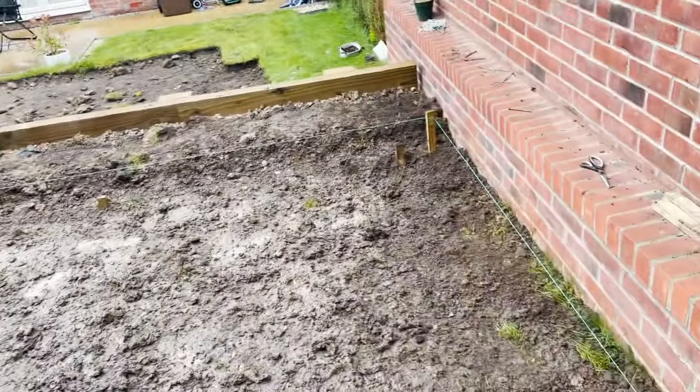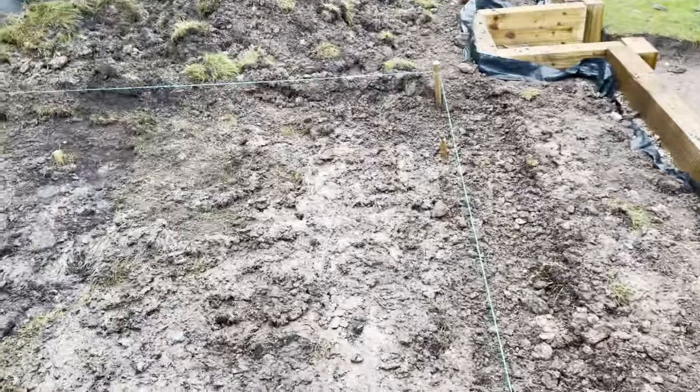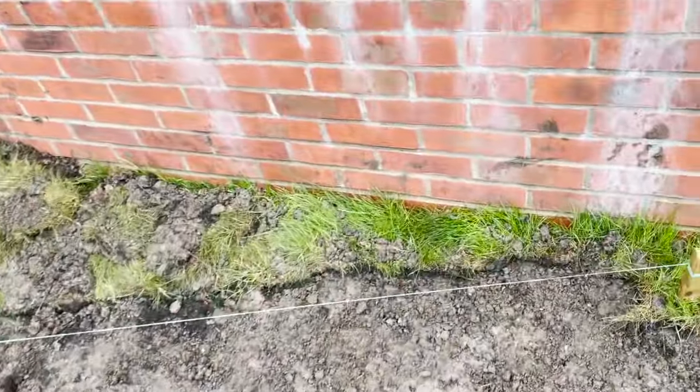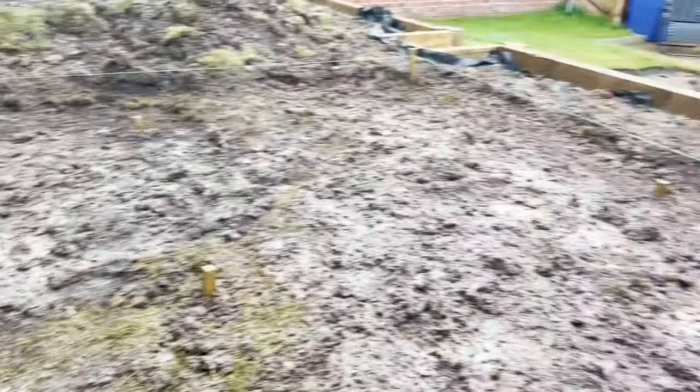There we go, we're done and ready now for the sub base. I had to use an extra — third — day doing this; absolutely back-breaking stuff, digging into all the clay with so many stones in there. We've gone an extra half a foot to a foot further than we strictly need to — I'd prefer to be on the safe side for the long term. You can see we've dug down this side here as well, and finally down the back too. I've left this bit of grass because it's not really in the way and it's compacted down quite a lot. All the sub base has been delivered today along with the sand, cement, and the flags we're going to be putting down.